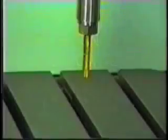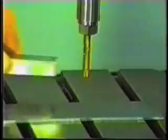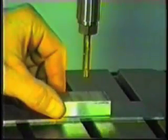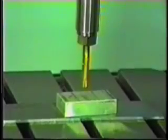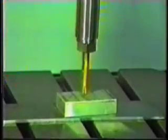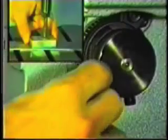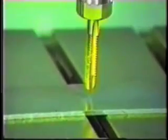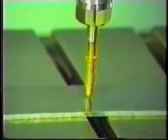First, a flat piece of material representing the bottom of the hole and another piece of material representing the length of the thread and clearance — our gauge — are stacked and placed under the tap. Now lower the machine until the tap brushes the top of the gauge plate. Loosen the reversing dog and remove the gauge block. Now rotate the spindle until the tap touches the plate representing the bottom of the hole. Next, adjust the movable dog until it contacts the reversing microswitch and then tighten.